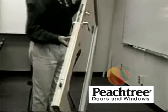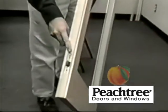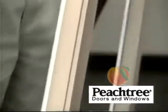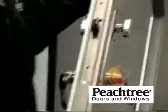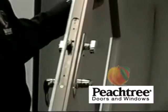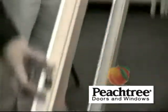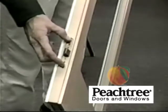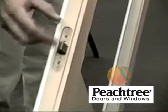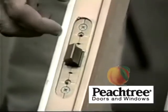I'm going to show you the modules, top and bottom, are the same, and the center mortise lock. Cover plates have been removed. On the top and the bottom module, which are the same, you'll notice the bolt is in the middle. You've got 2 wood screws, top and bottom, holding the module to the panel, and you've got 2 slots, one on each side of the bolt. It's important to note these slots.